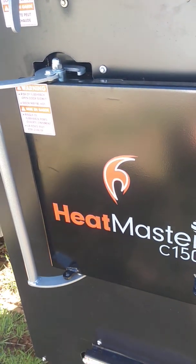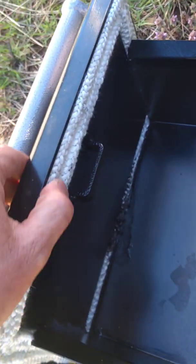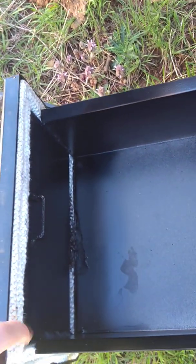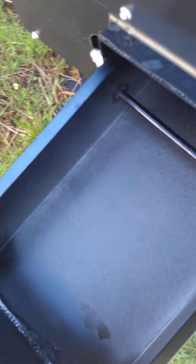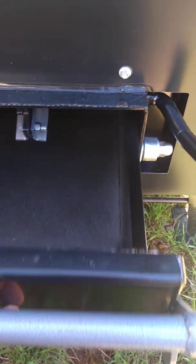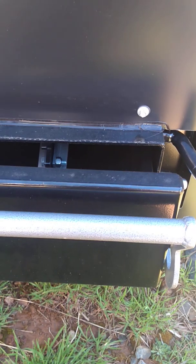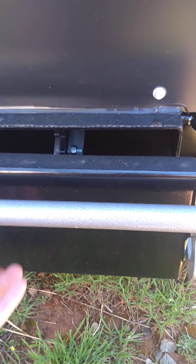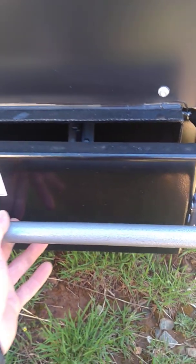On the ash pan, same thing — I'm looking for an imprint and checking that it latches tight. You won't normally see smoke blow out of the ash pan when it's running, because that's just fresh air; there's no smoke in the ash pan normally. There are techniques to check it — like putting a board over the chimney and letting the smoke push down into the ash pan with the fan on — but you won't see smoke there on an everyday basis.